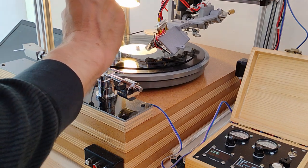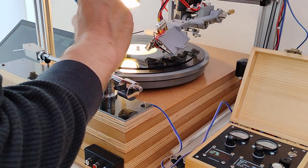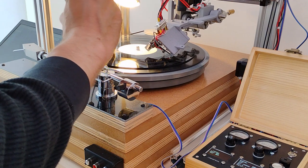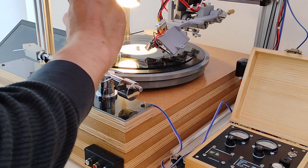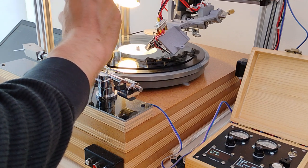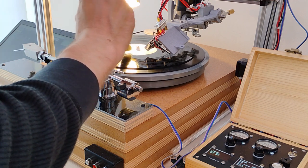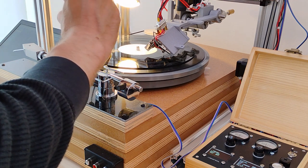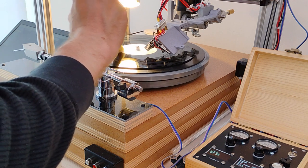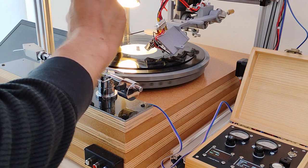Professional styli for record cutting often come with a tiny coil of wire cemented around the gemstone. This is a tiny heater, and when connected to a suitable circuit, it provides a controlled amount of heat directly to the stylus, softening the disc surface and easing the path of the stylus through it. Using heating in this way must only be done if the thread removal mechanism is reliable, because if a ball of thread collects on a hot stylus, it can melt into a lump and become impossible to remove.